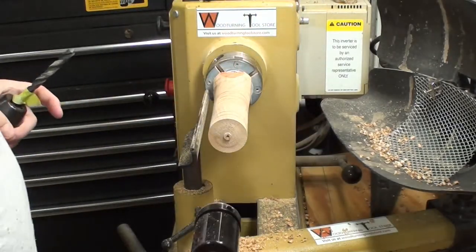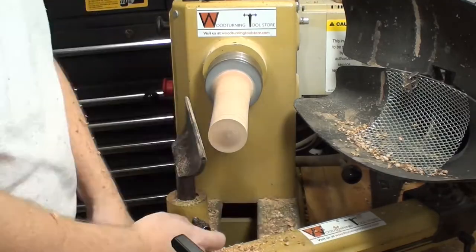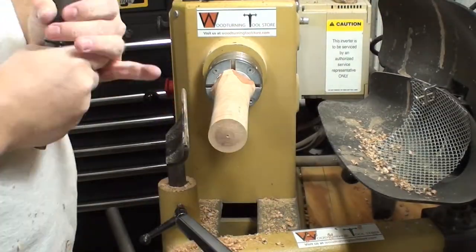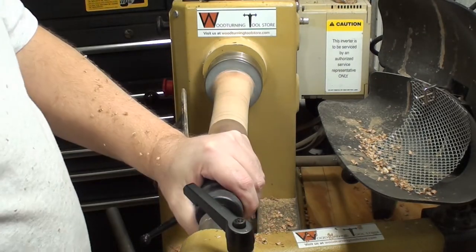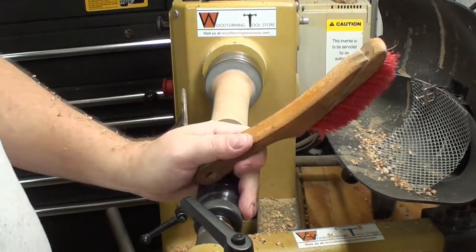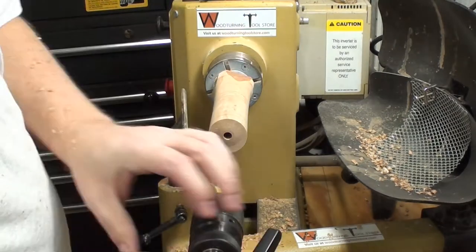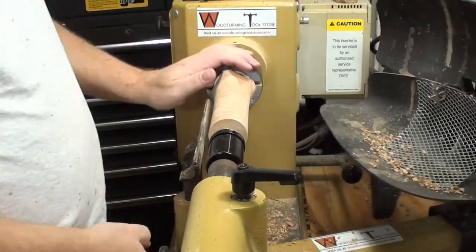Here we've got the drill, and we're just using the markings we made to set the drill depth. Trimming off the end, making a little divot, and mounting the drill bit. I got my drill bit a little cockeyed in the chuck and remounted it. Now we're drilling in — I use my brush to clear shavings off the bit. Down to depth: three and a quarter inches. The test tube is three inches long, so three and a quarter works.